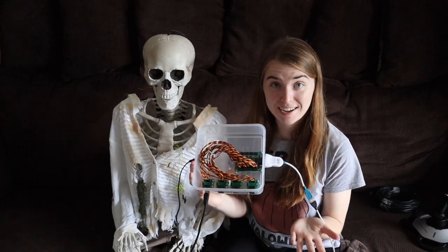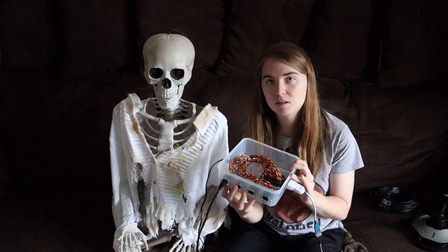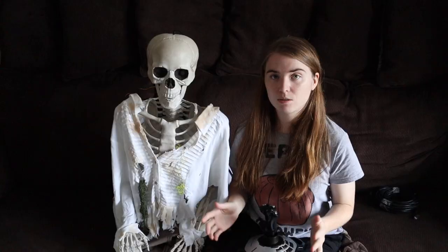I use this box for everything — it's great, it has a lot of uses. All I need to do is grab a receiving board and an Ethernet cable, and then just hook up whatever animatronic to one of these sending boards — whether it be all four pirates, just one pirate, Corvus if I'm not walking around with him, prototyping an animatronic piece like an arm or face, or even just a couple of bare servos. And with the software I use, I can use this box to puppeteer things for a video like this, test the parameters of servos once I've finished making an animatronic, test servos when they first come in the mail, and most importantly, I can use that box to record and run full shows like the Pirates Display.